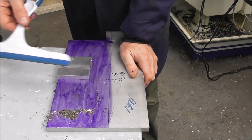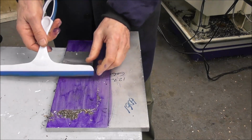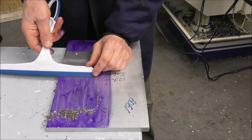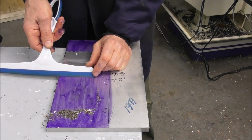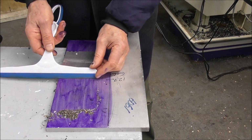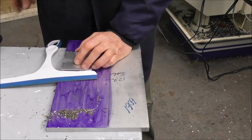Now you could say, oh well, that wiper wasn't contacting very well and was letting particles through, but in reality that's what happens on your machine. How often do you check the wipers have not worn and are seating 100% and haven't buckled away? In reality, the wipers may work well if they're good quality wipers and installed correctly for a period of time, but in most situations they only work partially, and they may even trap the particles under there once they get through. And so while they're reassuring to look at, in practice they probably don't do much more than wipe away the large pieces of chips.